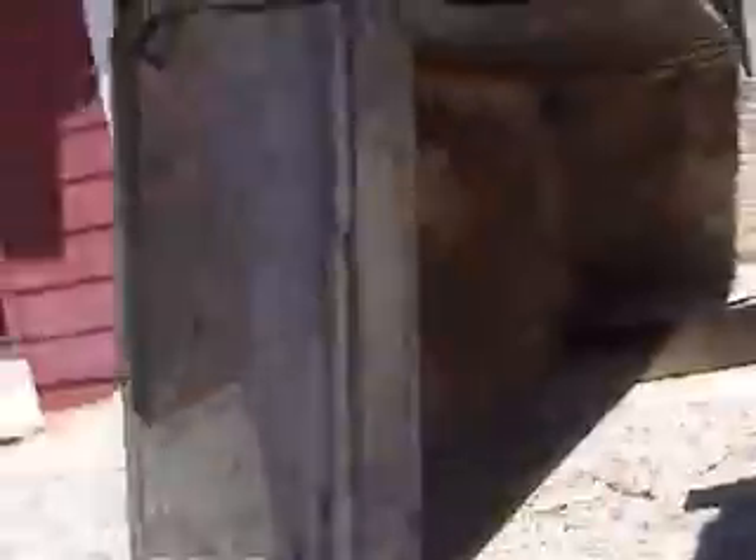Okay, that side's clean. Now what I'm going to do is go ahead and weld this end first, fill in these little voids, just like I did on the last one, weld around back in here. I want to make sure that this end is welded up and strong before I go to horking on it, because if something bends or gets out of alignment that would be really hard to get back true. So I'm just going to take care of that now so I don't screw myself later. When I come back, it'll be a finished weld — so, before.